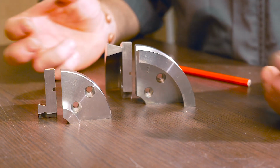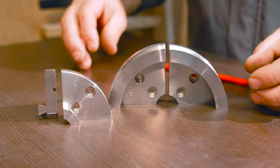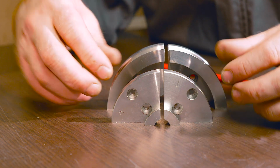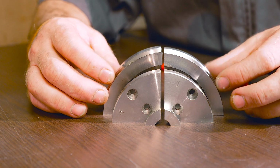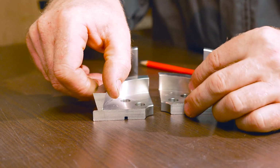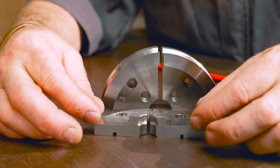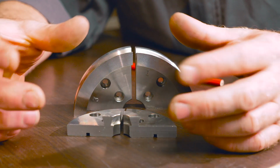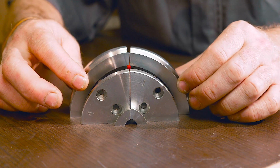So in that range of dovetail jaws, we've got mega jaws, very large. There's our half circle. We've got our little F's and D's, which are much smaller. So giving you an idea of diameter sizes, how much different these can be to suit that variety of work. So we've got lovely large dovetail on here, great for big bowl work. Much smaller size, smaller operations. So you still can use that, expand out into the bottom of the bowl. We can still grip down on the internal face as well. So either way will work. Quite a variety in sizes.